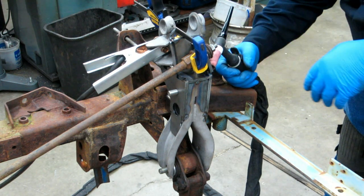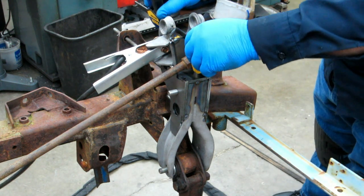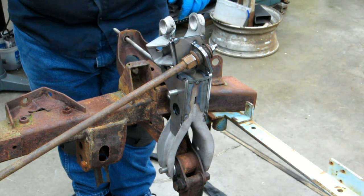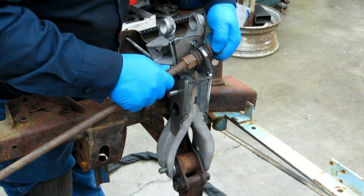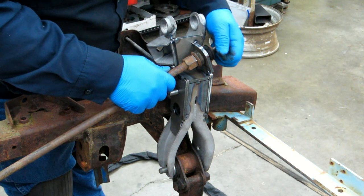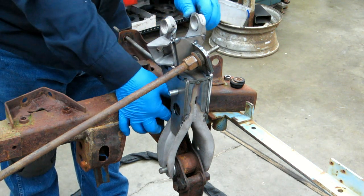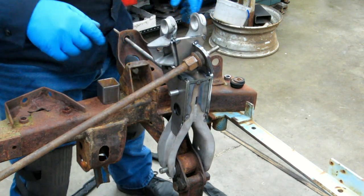Use a little bit of rod there with the tack weld, because trying to get it to melt across the gap there can really take quite a bit of heat, and you've got to kind of float it around. It'll do it, but having a little rod right there sure makes it a lot faster. That block is in there just to keep this from bouncing around.